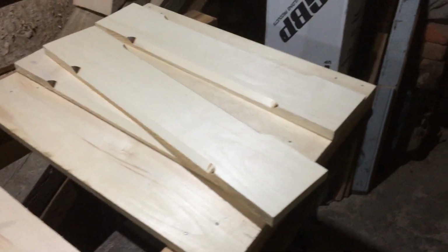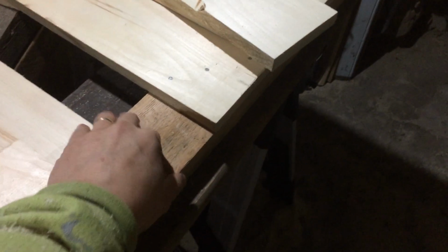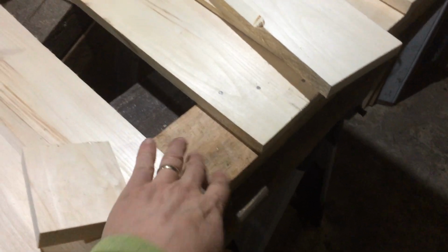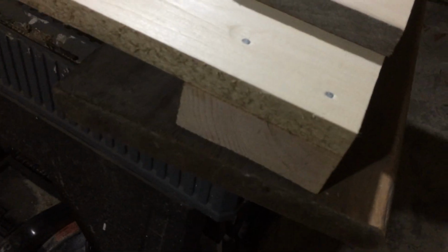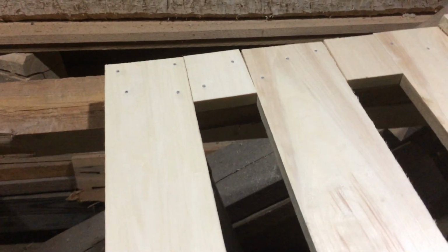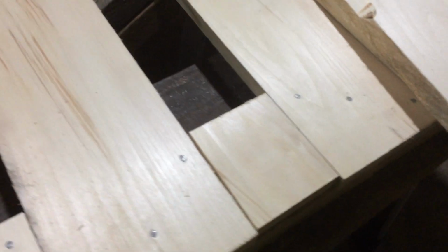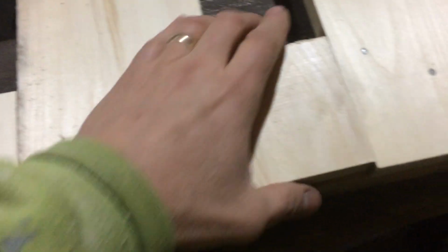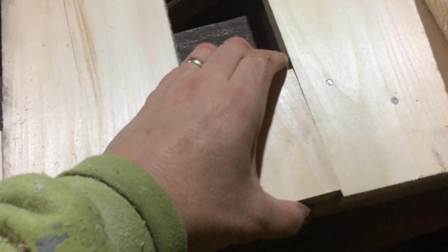And it's going to cover it up for the time being because it still could be some time before we get the stairs on. So we started with a 1.5 by 4 inch hemlock, which was left over from the floorboards. And we're nailing on this 3/4 inch poplar. And you can see what we did. We just put straight pieces on, any that had bad edges, put them underneath, put the spacers in, keep everything the right distance. And so when we paint, we don't have that dead area there.